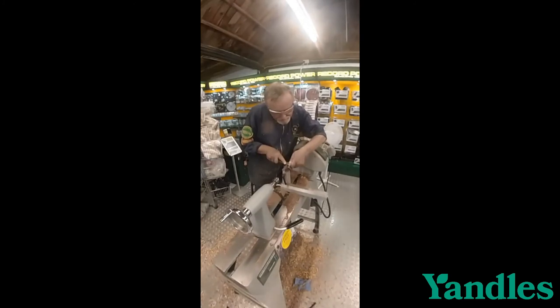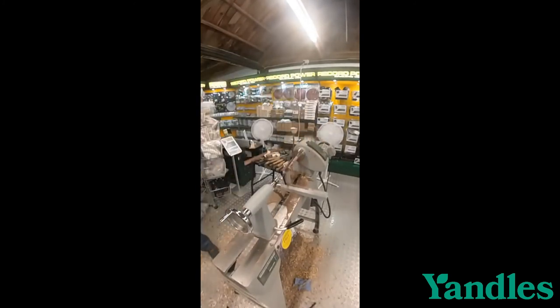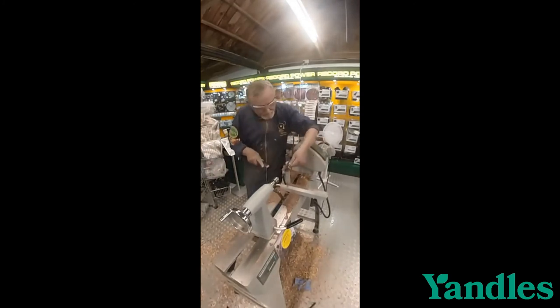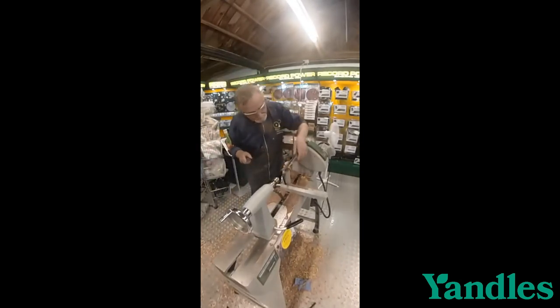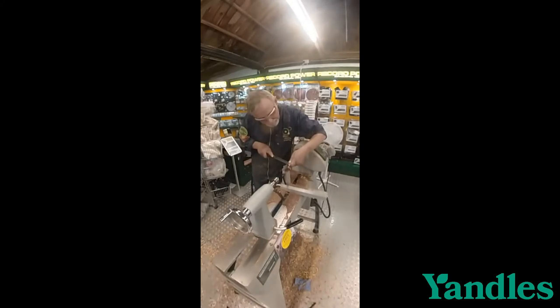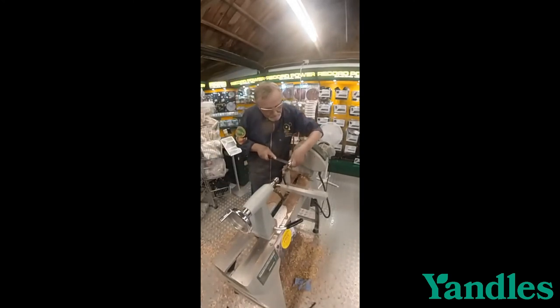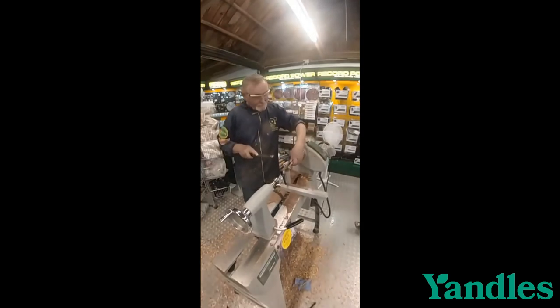But if I wasn't happy, if this was jiggering around at the moment, I would put the tailstock somewhere around, on to support one end, just to stop it vibrating. You always do a free hand. Yes, I do, by preference. You might break the first one or two, but say it's pennies worth of wood. I find the biggest mistake wood turners make is they get a piece of wood, they get some time, they're going to make something. Stop. Go and practice something.